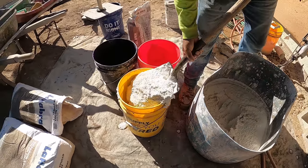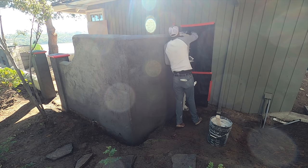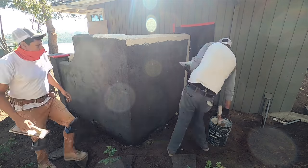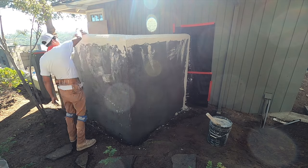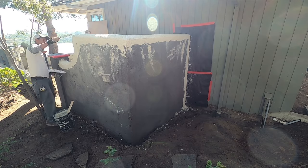That's a nice mixing pail to mix your stucco up in. So here's where that scooper comes in that they made on the job. It's just a quarter, the bottom portion of a 5-gallon bucket nailed to a stick. They use that to scoop out onto that hawk.